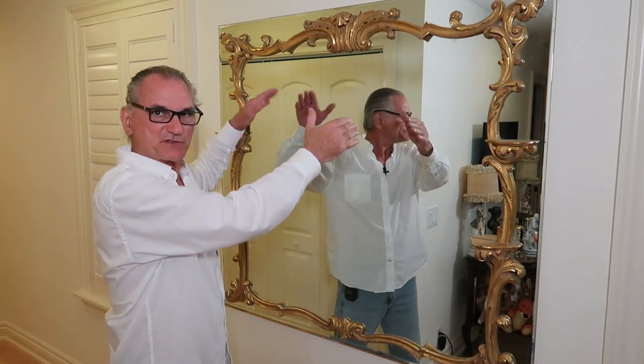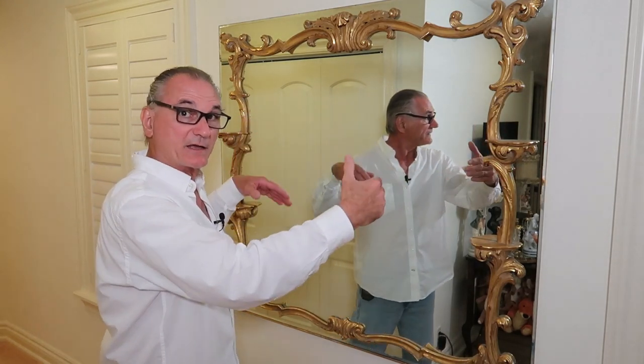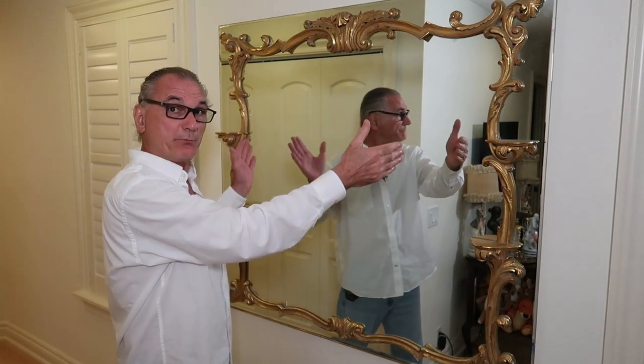I wish I'd known about this when I hung a Starry Night picture with myself 13 feet off the floor on three screws. When you have a French cleat, 90% of the weight needs to be matched up with both cleats. So with a 45-inch cleat, 90% means I can go 10% left or right — that's four and a half inches. Once you go over four and a half inches, the stability of the object you're hanging becomes compromised.